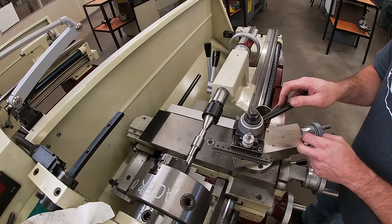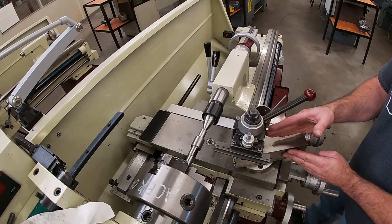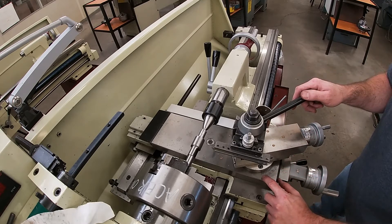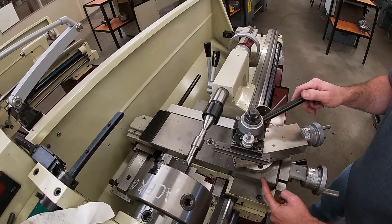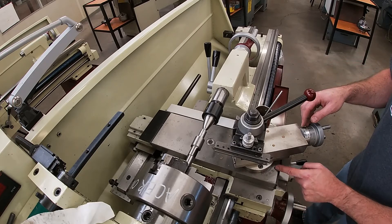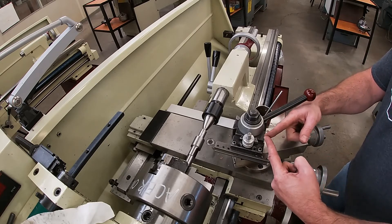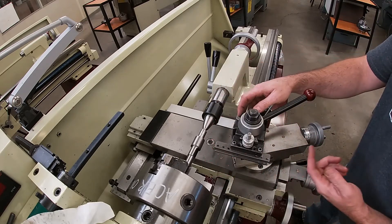At this point I should also mention that the compound is 30 degrees of rotation from being in line with the cross slide. On this lathe, it actually happens to be at the mark that would read 60. So this is a lathe where a student would often turn the compound until the mark lines up with the 30 on the cross slide — but that would be 60 degrees of rotation, which would make a 120 degree included angle thread instead of the correct 60 degree included angle thread.